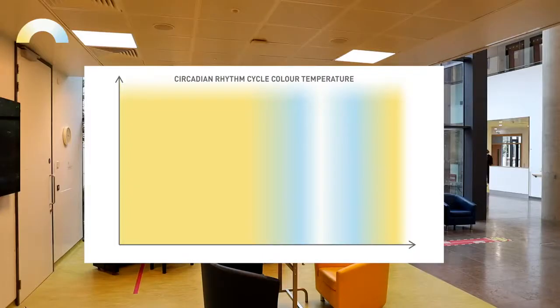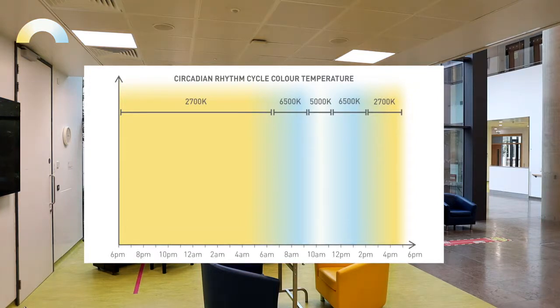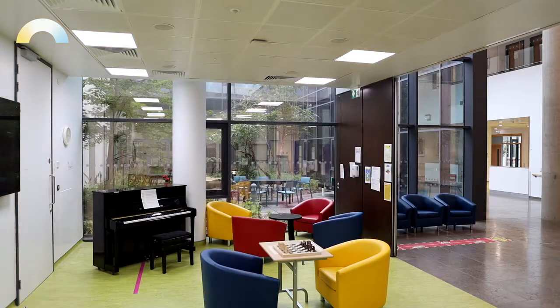Cycles are different to scenes on the modem in that they operate on a 24-hour constantly updated cycle. The HCL cycle initiates a 24-hour human circadian rhythm cycle that simulates the light output during the autumnal equinox. Light is constantly on but varies the blue content. The human circadian rhythm is the body's natural 24-hour cycle that needs to be reset every day. Melanopic light is a primary way of resetting your body cycle — it puts our body into day mode and sets our body clock.